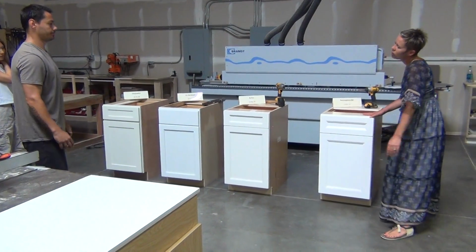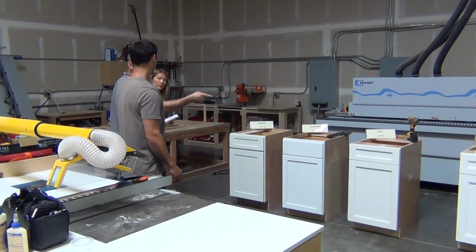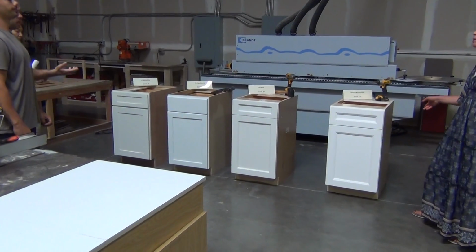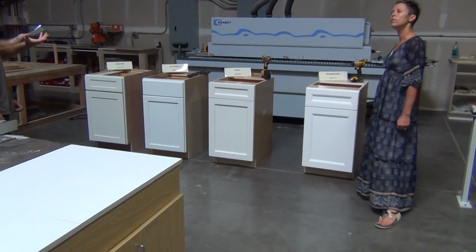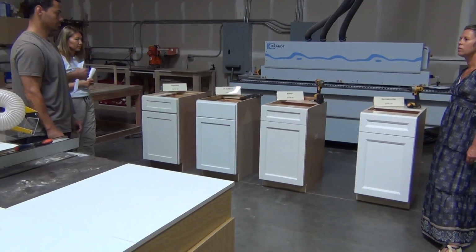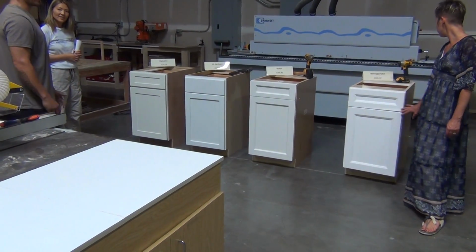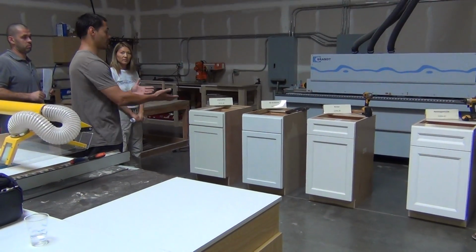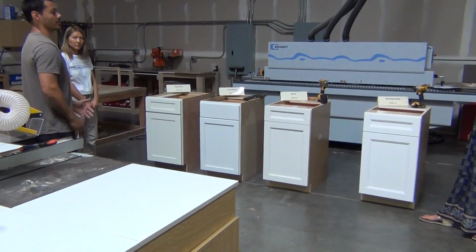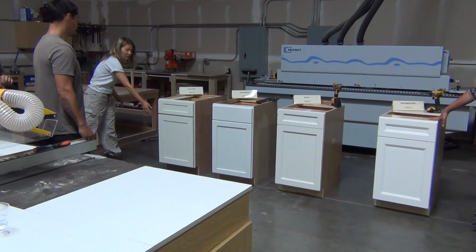Recover something. And that's where the finish comes in. Again, if you want to refinish it, that's easier to deal with than any of these conversion varnishes. Oh, the water-based. Correct. You're going to be able to refinish it or hire a guy or company to refinish it. These are very difficult to touch up or refinish. That's a good point. And plus, like you said before about it being toxic, if somebody was in your home spraying this type of varnish as opposed to our water base, you'd be dealing with moving out of your house for a week.